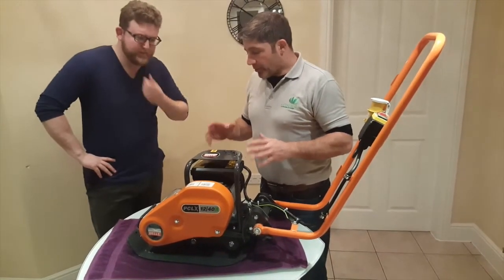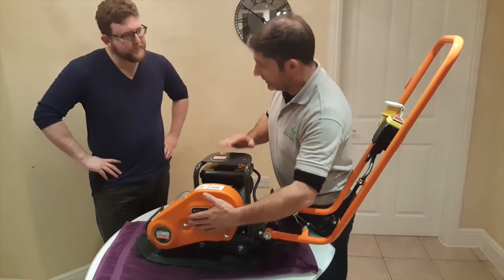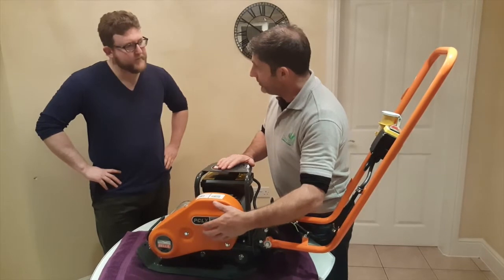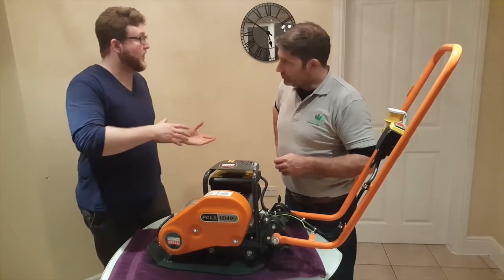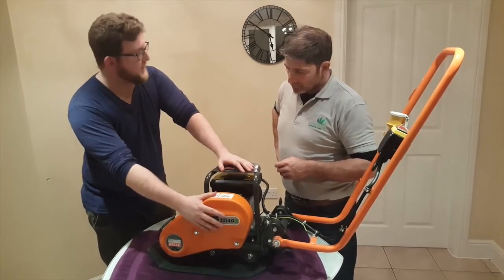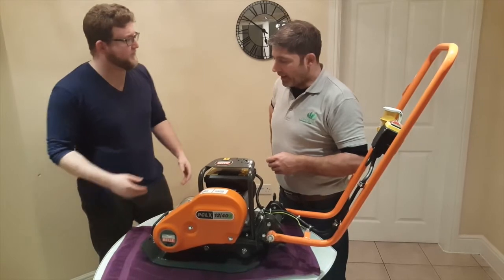One of the things I've noticed is that it's got a side panel like standard compactor plates, and it's quite easy to take this panel off and change the belt. There's going to be very little maintenance you'll ever need to do on an electric motor, but you might need to change the belt every now and then. Just a couple of screws, move the plastic cover, and you have access to the belt. Really nice and simple — which is what you want as a contractor.